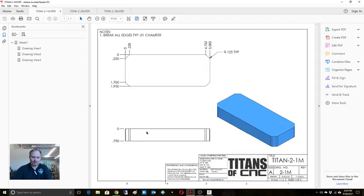It looks like we've got a 3/4 of an inch depth overall. So it's basically a rectangle, right? We do a 1/4 inch chamfer on all the corners here. However, it also puts an 1/8 inch radius on each of these, and you can see it in the ISO view. We do a radius, so it's not a sharp edge. Nothing fancy, this one goes pretty quick. So I think we'll get that done.